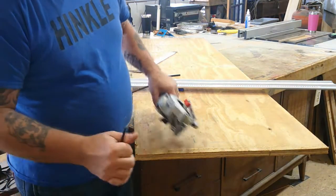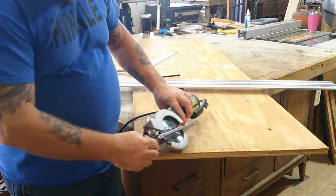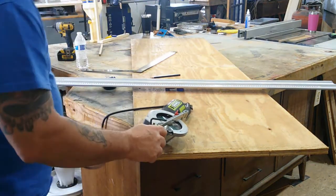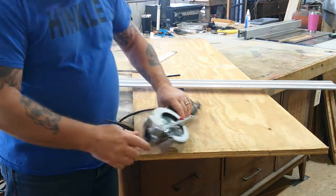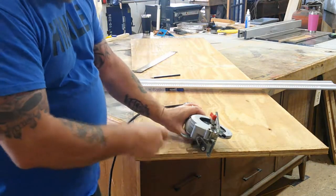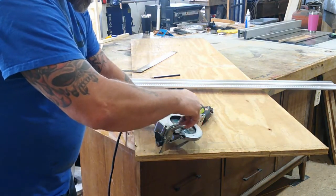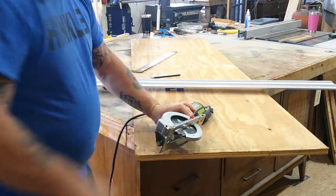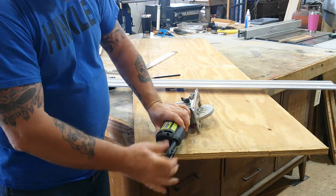Now what you couldn't see was the blade was loose. It was stopping on me as I tried to run it through the board there. Unplug the saw for safety. Now this saw comes with a nice blade stop. It's right there. That red button comes with the Allen wrench to tighten the blade. We'll put a little Armstrong on that and it'll be good to go. Yeah, and the tool goes back into the little compartment there on the lead cord.